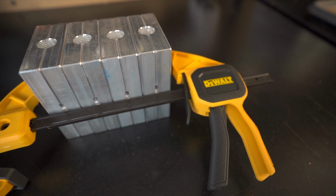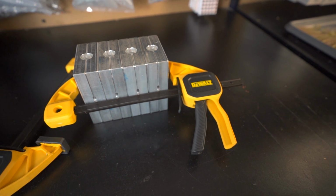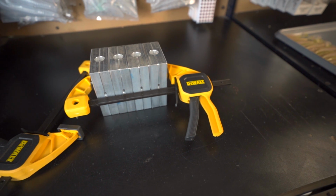One of the last accessories that are a must-have are clamps. I like to use heavy duty clamps. It's gonna keep that mold nice and tight together so you don't get flashing. Flashing is what happens when that Plastisol squeaks through the cavity of that mold and then comes out the sides, and you have this weird little funkiness on the outside of the bait.